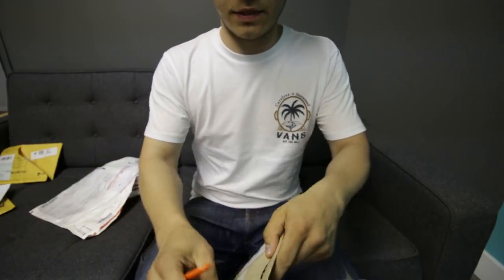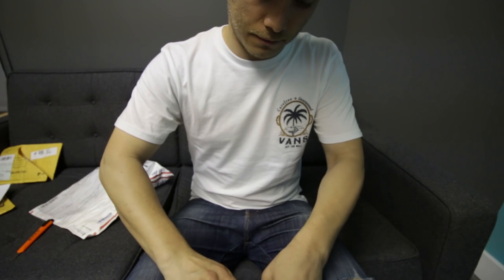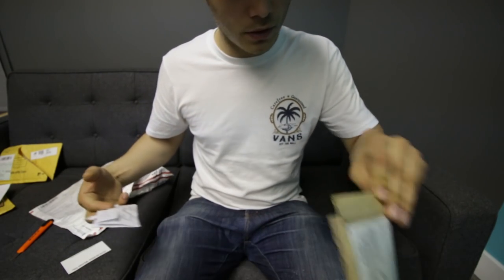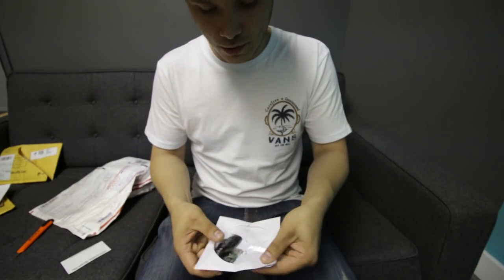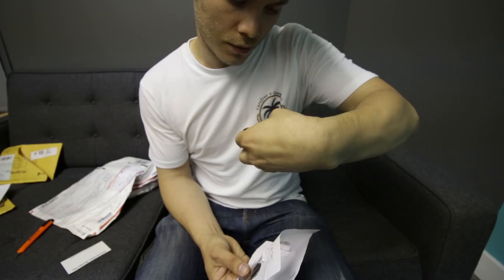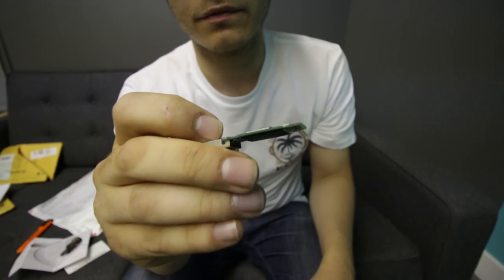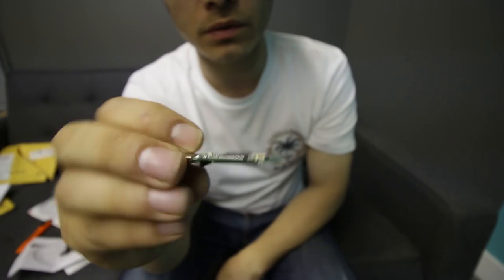These envelopes are dusty. I don't know what they use — it's like recycled paper on the inside or something. I know who this is. It's an older SanDisk, 4 gig. These Cruisers with big controllers like this usually tend to be really tough to work with due to dynamic NAND or hardware encryption. Hopefully we'll figure this out.